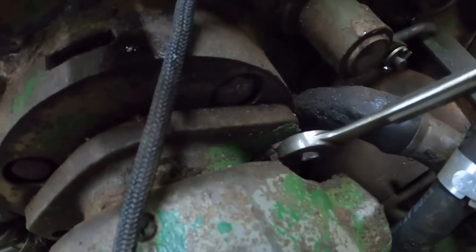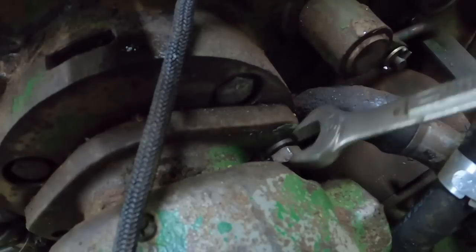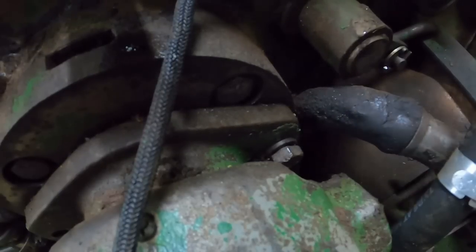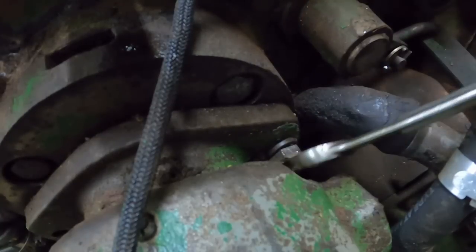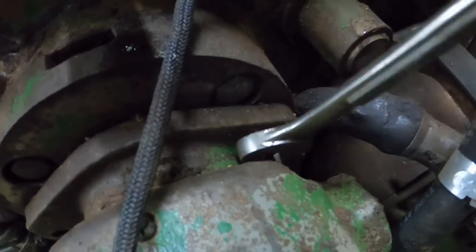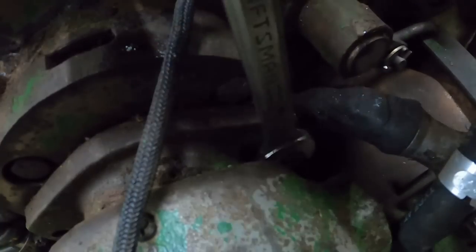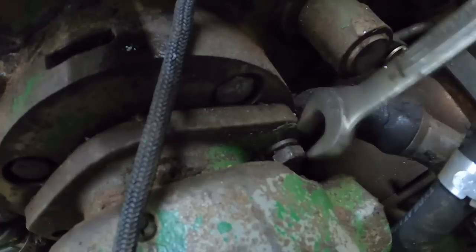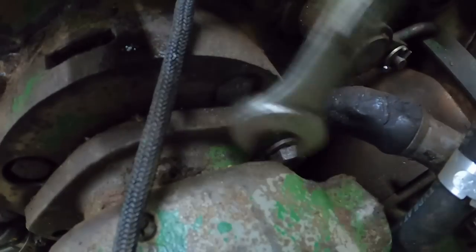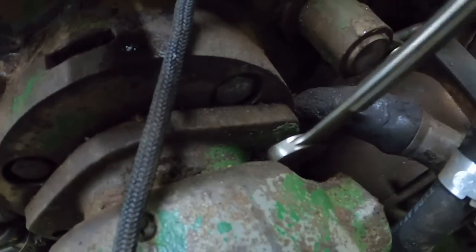I'm definitely glad I'm swapping it out now instead of firing it up, finding out it's either worn and making a lot of heat. Heat ain't necessarily a bad pump. It could be a relief valve that is blowing or something else. But when these pumps do get worn, a lot of oil bypasses internally and they get hotter because of that.